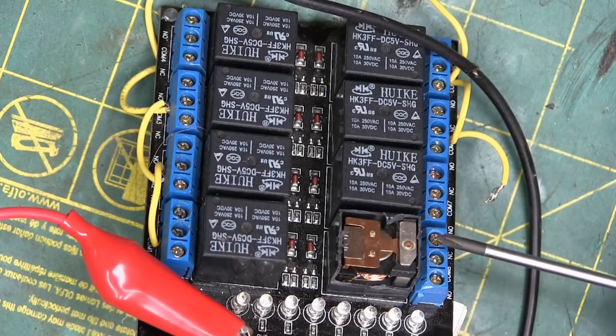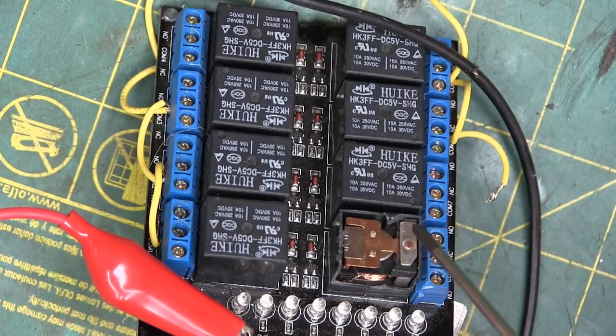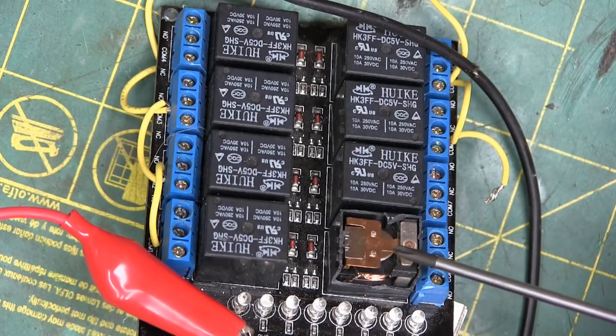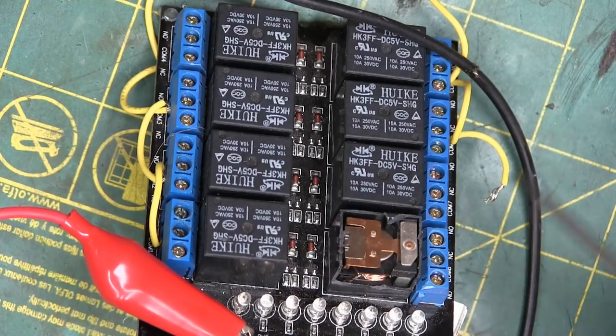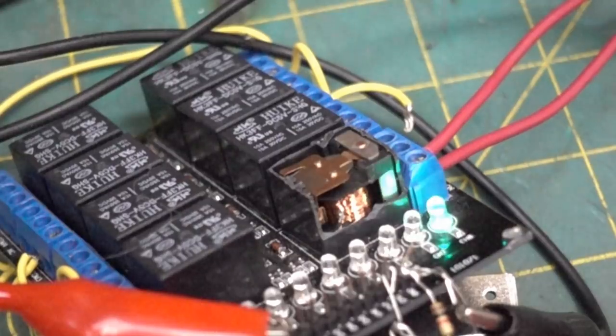After 2.5 million cycles, we see this thing is still chooching just fine. So what gives? How come it was glitching out? Well, the resistance of the contacts is quite high. I wonder if we'll be able to catch that on high-speed potato vision. I'm going to try and get a big spark through there. Here now in slow-mo is the relay under load. You can see the arcing and the sparking. I got it short-circuited on the normally closed, 7 amps, 30 volts.